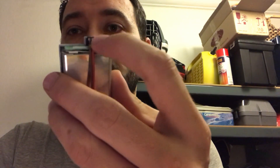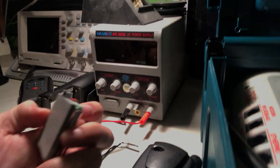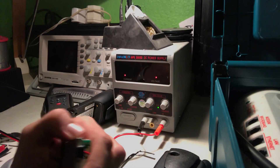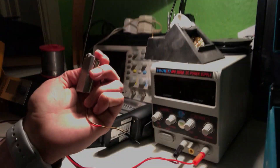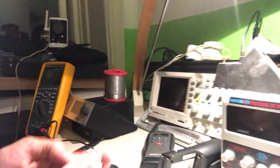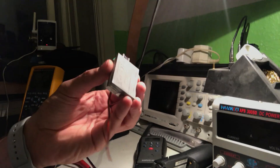I put half the shell of the battery off so the terminals were exposed, then put the battery inside the camera — and remember, there was nothing on those terminals. Then I connected a cheap Chinese power adapter and set the voltage to 8.2 volts. I turned the camera on and off, and it said 'low power,' so I raised the voltage to 8.3 or 8.4 volts, and it just turned on and started working.